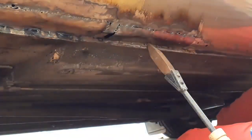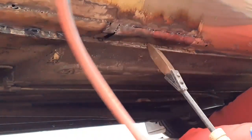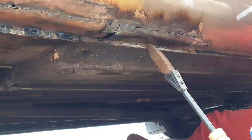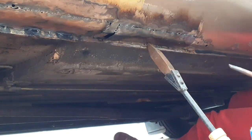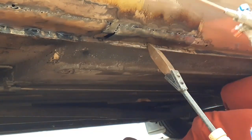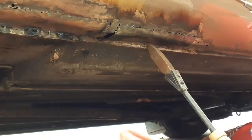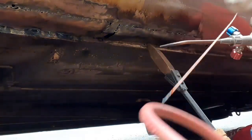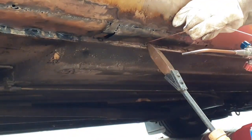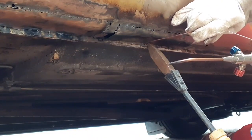I've put a larger, a number three nozzle in the torch, which is a bit thick for welding 0.9 millimetre steel sheet. But the flange is two folds - it's two sheets welded together, and the number two nozzle just can't quite cope. So I'm using a number three nozzle instead of a number two.